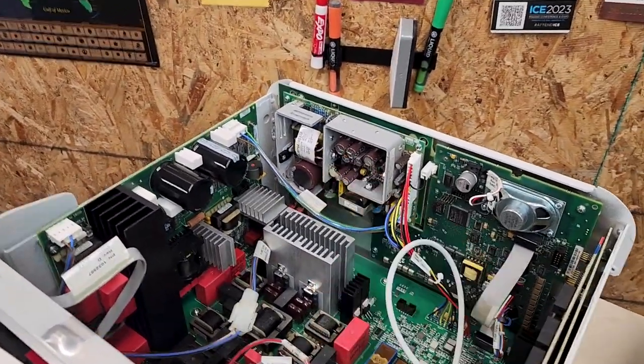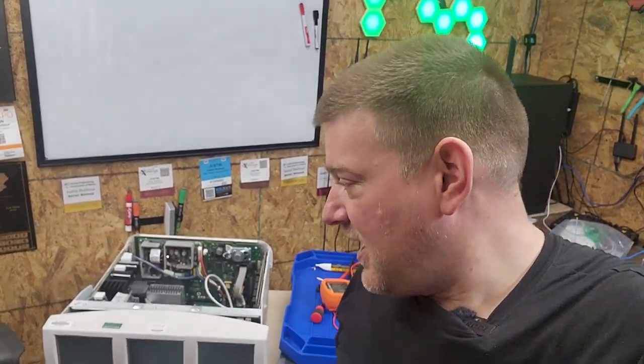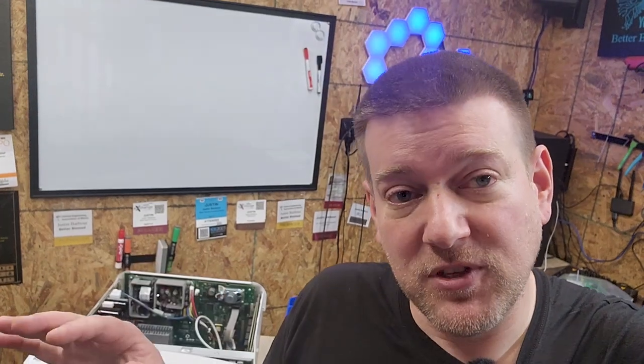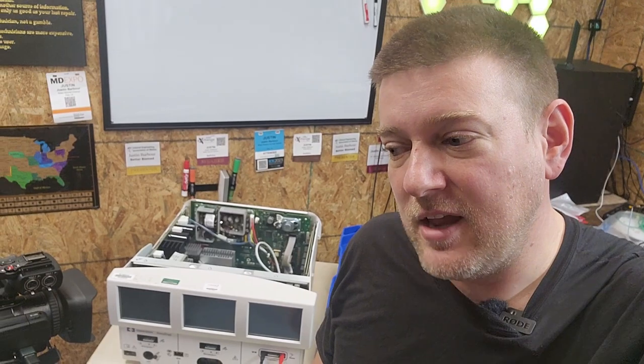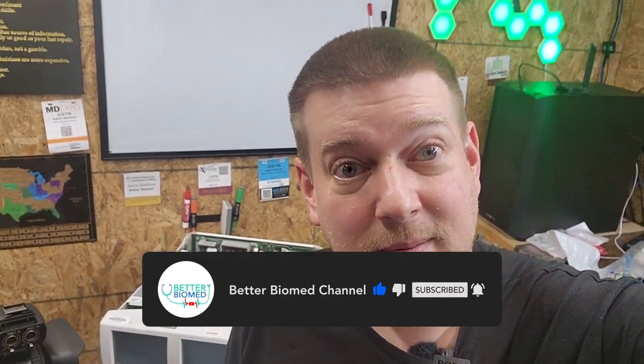This unit back here was extremely hot, so it was a no-go. What turned out to be a calibration video showing how we do what we do turned into an unfortunate casualty. We'll get the fuse back in and get it back up and going, and I'll finish that current measurement - unfortunately starting all the way back at zero. What I should have done is after the voltage calibration, stopped, given it 15 or so minutes to cool down, then gone into current calibration. Going straight from voltage into current calibration put the extra strain on the unit. Let's replace that fuse and get it back up. Thanks for watching.